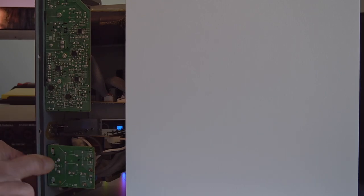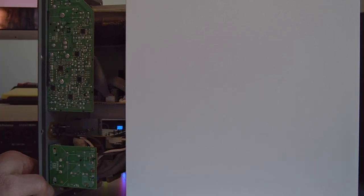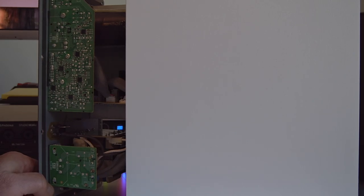And on this second speaker, because I wasn't as careful, I had to go back and cut some of that out because that's exactly what I did. Fortunately, it didn't fry any of the electronics. It just grounded the input signal. So when I went to connect a signal, I didn't get any sound coming out through the speaker. So after cutting that out, it no longer was grounding the input pins, and the sound came through just fine.